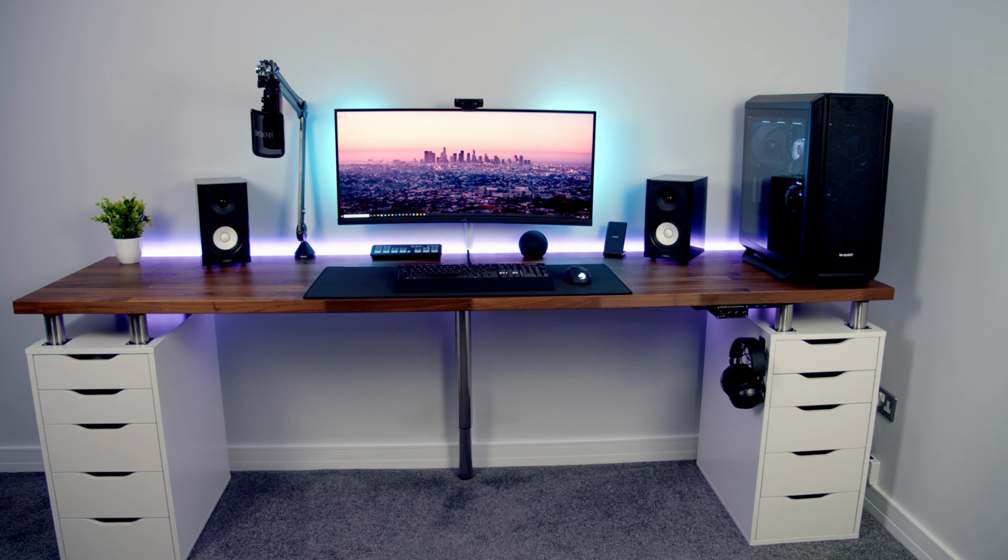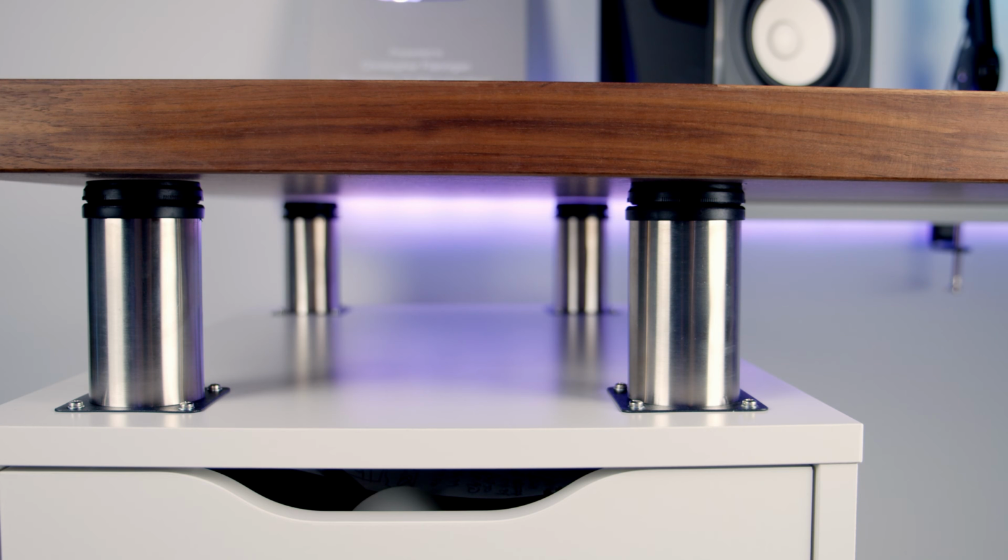Rather than sit the Karlby countertop directly on top of the Alex drawers where it was going to be too low for my own comfort levels, I have it raised up an additional 4 inches on top of some stainless steel kitchen legs. And again, you'll find links to these particular legs in the description. So I've got 4 of these legs on each of the Alex drawers, and I've actually gone ahead and bolted them to the Alex drawers. I might well have got away with screwing them on, but the countertop is pretty heavy and I wanted to make things as secure as possible.